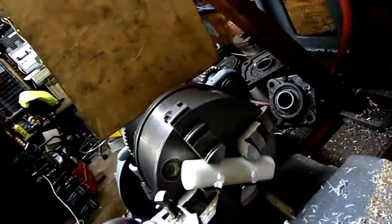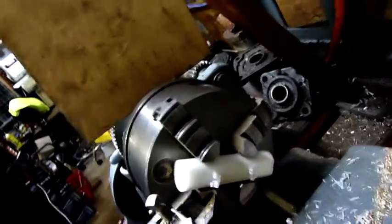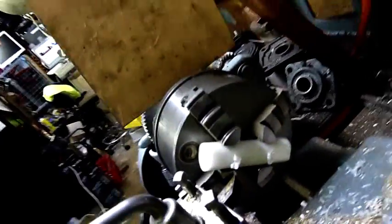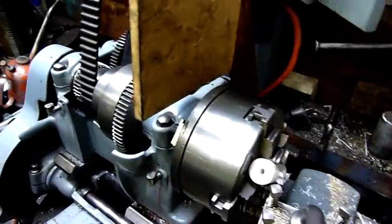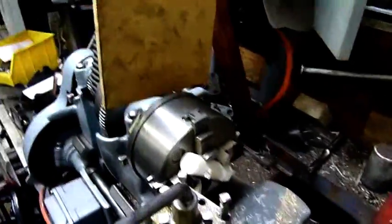I figured I'd better improve the AC input and put a little terminal block here. The trouble is it's still a bit flexible and it puts load on these pins coming out of the rectifiers. So I'm doing a bit of machine work with a bit of acetal to make a spacer. I've already cut it and now I'm doing something which is kind of dangerous, but because it's plastic it's not really liable to damage the chuck or come flying out — I've just clamped it between the jaws of a synchronous four jaw. I don't recommend trying this at home.